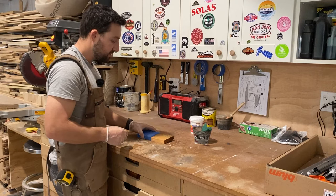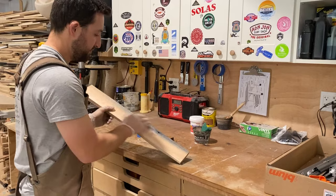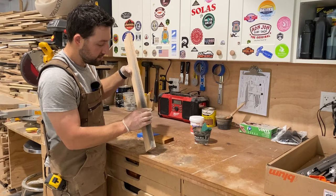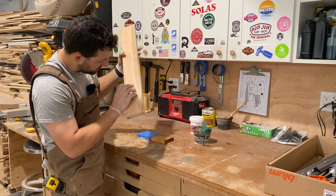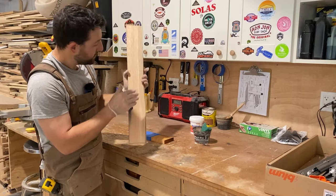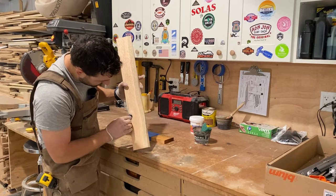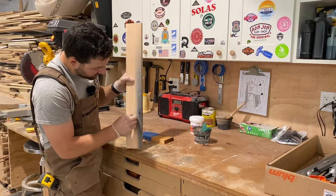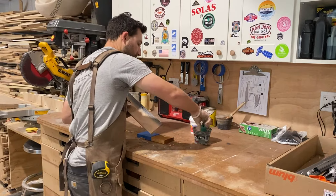I'm going to find a darker piece to show you just how bad this spot actually was for contrast. This is the same piece of red oak from the same tree. This staining is caused by nails in the tree — it's actually the iron nail rusting and oxidizing in the wood, creating this black look. This is where the nail was, so this is the outside of the tree, and this gouge is from where I pulled the nail out before I milled it. You can still see the scarring from the tree growing around it, and right here you can see the tiny little hole the nail was in — it just stained the whole thing.